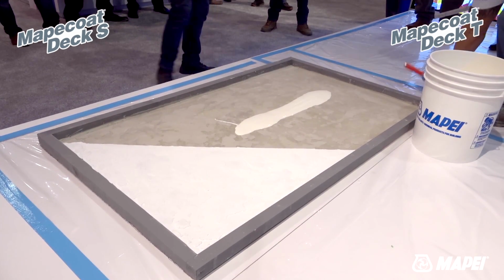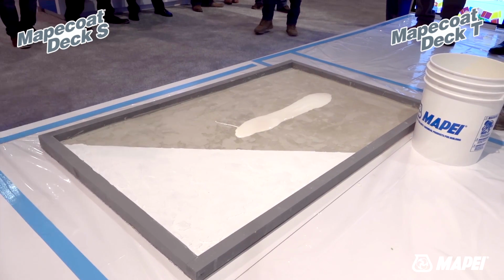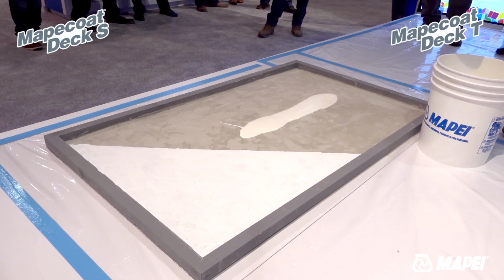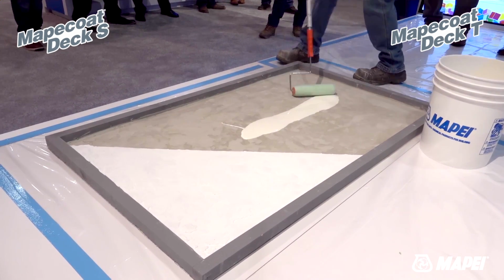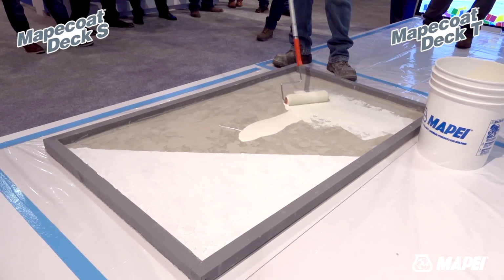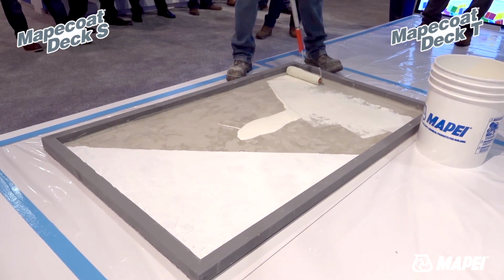Now it goes on a lot thinner. It doesn't contain a texture. Is it a moisture-cured urethane? It is not. It's actually a polymer. So it just polymerizes. It coalesces in just the regular atmosphere. It doesn't require moisture to cure.